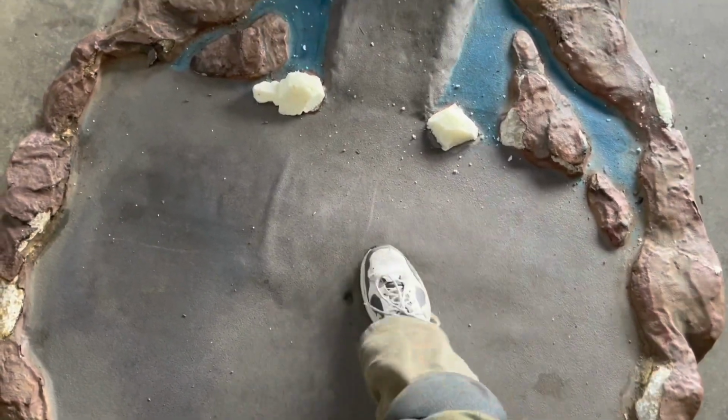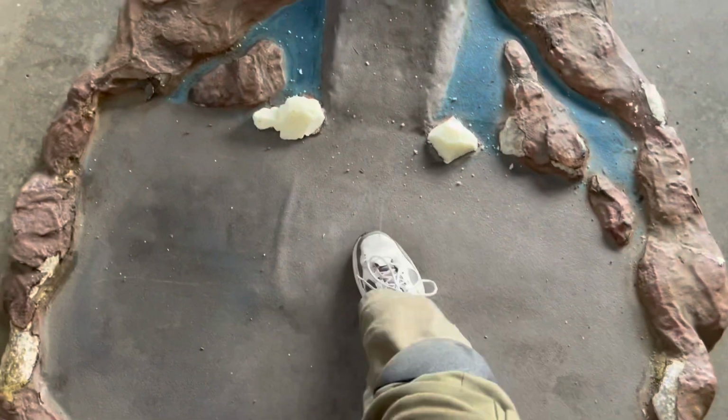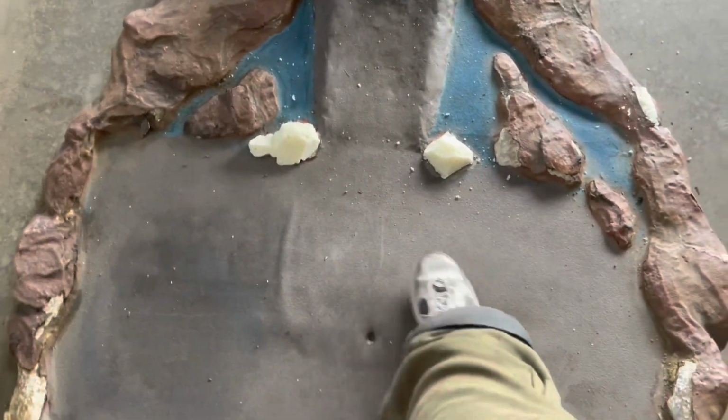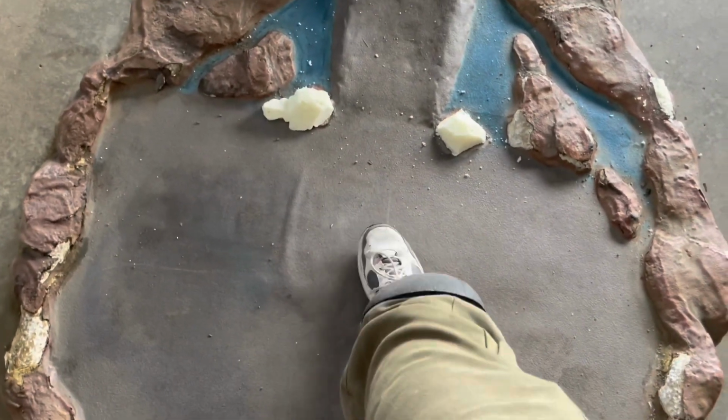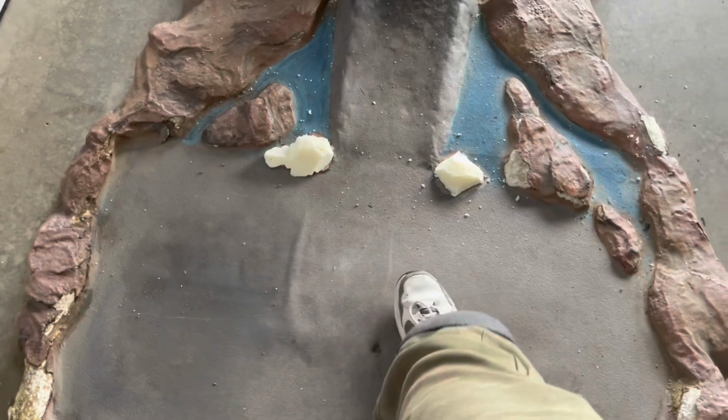That's just the downside of these being on an outdoor patio that gets wet routinely, and these being built out of what I assume was untreated plywood, because the podiums are also plywood. It was probably the same plywood. Maybe it was treated, hell, I don't know. Maybe enough exposure and people walking on it and water and temperature changes out here finally caused it to start to separate and delaminate. But I have a feeling it was the water soaking up from underneath. I don't know if I want to deal with that.